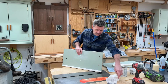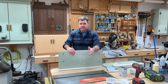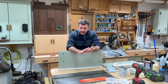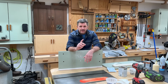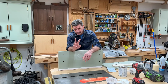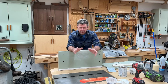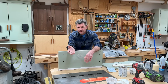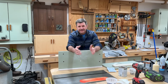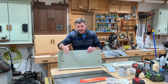So what my process is when I'm painting a wall, like trimming and painting a wall, I'll do the trim work, of course, first. Then I do the fill with the joint compound, sand everything, prime everything, give everything one coat of finish paint, and before the last coat of finish paint, so I'm going to get 2 coats of finish paint, before the last coat of finish paint, that's when I'll caulk. I'll let the caulk dry overnight, and then I'm ready to paint. What I don't want to do is do any sanding after I caulk, because then you can maybe hit the caulking with the sandpaper and pull it out and make a mess.